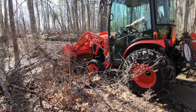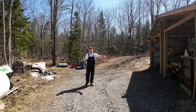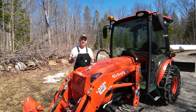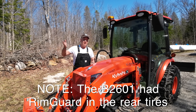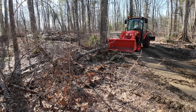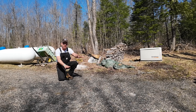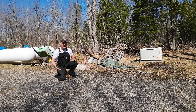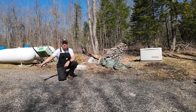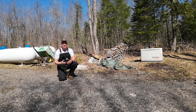I'm doing my best to bucket this gravel and spread it over in that area, and the B2601 is literally almost flipping over on its side. The butt end of the tractor keeps coming up off the ground, and I have no idea why. I eventually shut it off and call my dealer. I tell him there's something broken on the tractor — I'm literally that naive. Every time I cross part of the slope to spread gravel, I feel the back starting to feel light, like it's being lifted — and that's because it was. The right rear tire is literally coming off the ground and the tractor is tilting over. And for the first time I learned about the importance of ballast.